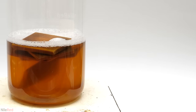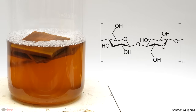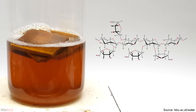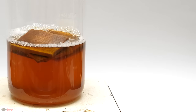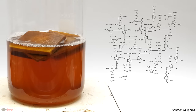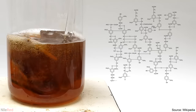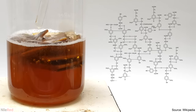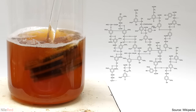To understand what's going on here, I first need to quickly go over the basic composition of wood. Wood is made of three main components: cellulose, hemicellulose, and lignin. The cellulose is an unbranched polymer made of glucose, forming long chains usually between 7,000 and 15,000 units long. The hemicellulose is a much shorter branched polymer, usually between 500 and 3,000 units long, made from a mixture of glucose and other sugars. Together, these two biopolymers form the major framework of the wood, but alone they aren't very strong. So to increase the strength, the tree uses another biopolymer called lignin - even more branched, with no real defined structure, just a random network of phenolic units. It serves to crosslink and hold in place all the long cellulose and hemicellulose fibers, and also fills up the empty space.